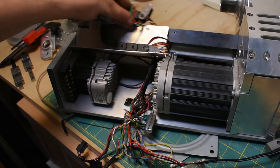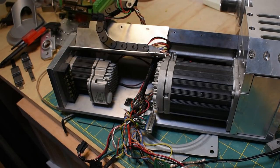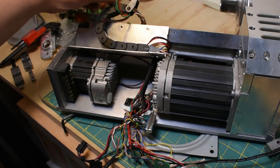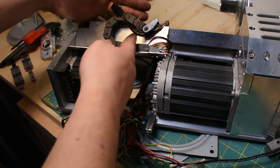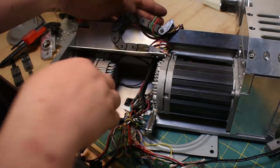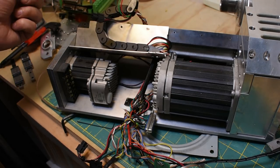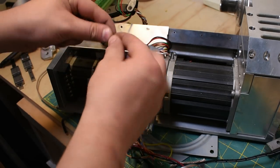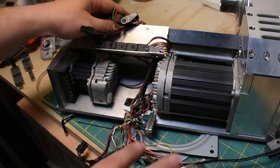This drag chain. So that looks pretty cool, right? I'm not convinced that it's what's needed. If you're not familiar, a drag chain, basically you put your cables through it and it ensures that your cables are bent in differing places, not all in the same place, which prevents the Apple headphone phenomenon of the one place bending back and forth so much the continuity gets broken. Like I said though, not sure it's totally needed.